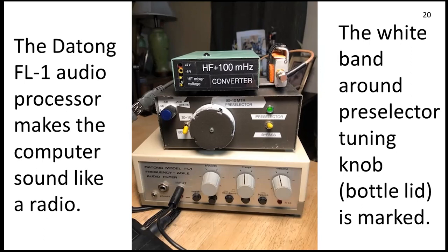The weather balloon frequency depends on which model they're using. Ours is around 1680 megahertz, other weather service offices use around 403 megahertz. You probably need a preamp in front for 1680 MHz — I'd use an external power injector rather than the built-in bias T. Use whatever that site recommends so you know how much current is drawing. I recall the weather balloon tracker uses a little amplifier. You could put a small beam antenna up for that — 10 minute warning, I'm about done.